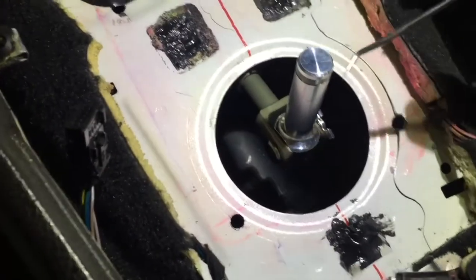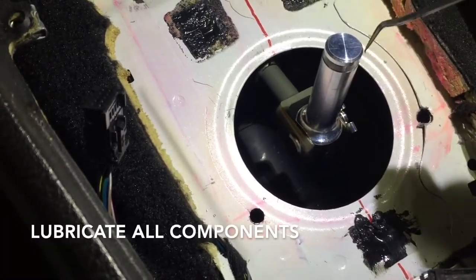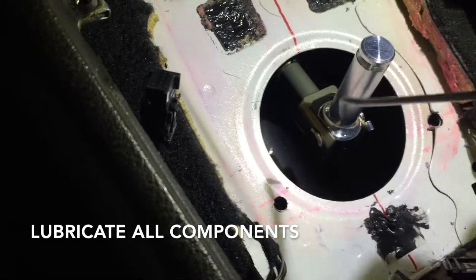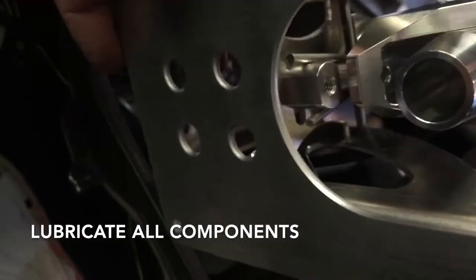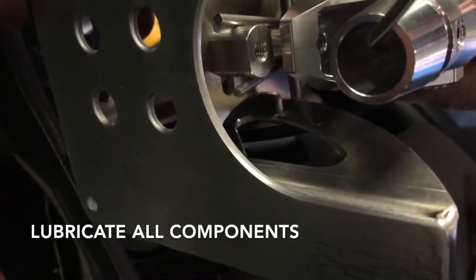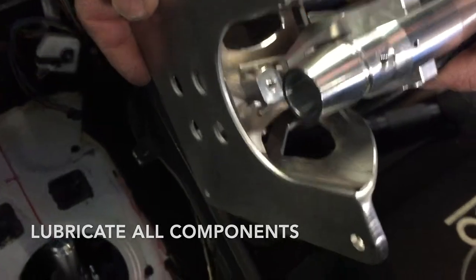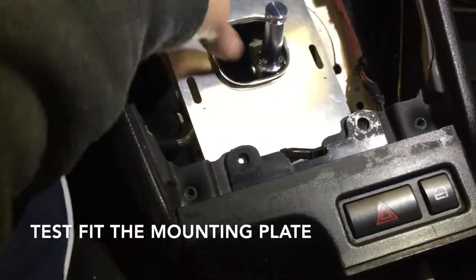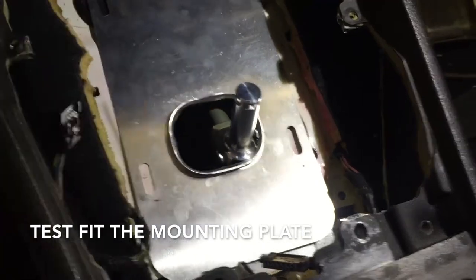We're working on our final assembly so you want to make sure you lubricate. You're going to lubricate the shaft, this groove, and inside the fork — it's penetrative so it'll get in there and do its job. Since we're on final assembly, we're also going to lubricate inside the shaft. For future use, you can use the hole that's right here — it'll get in there and you want to do that as general maintenance. With everything in place and clean, you can put in your mounting plate. Make sure that this lip is up because your rubber boot is going to mount to it — go ahead and get that all lined up.